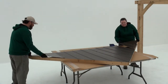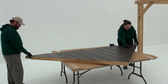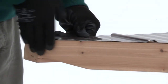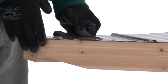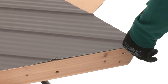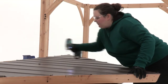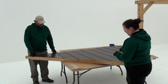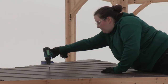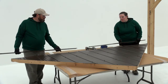Next, position the short panel left and short panel right onto the roof rafter assembly so that they overlap the edges of the long panels. Make sure they're flush to the sides of the corner LT and corner RT and there's a slight overhang of the fascia beam assembly. Make sure the panels don't overhang on the sides — if they do, loosen and remove the roofing screws, adjust the roof panels so they're aligned correctly, then replace and tighten the screws. Now insert the remaining roofing screws into the panels.